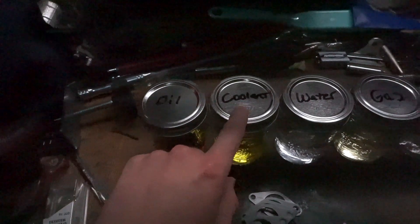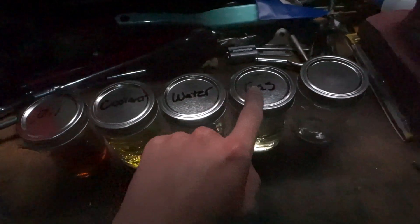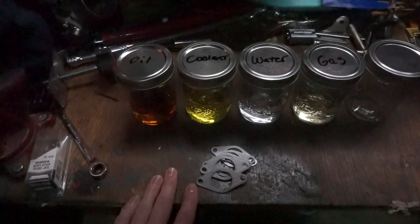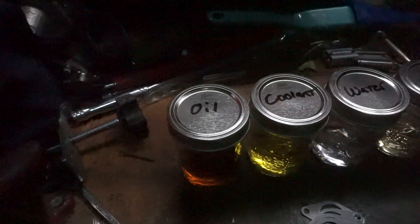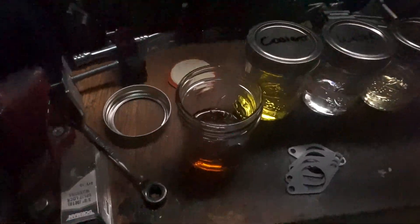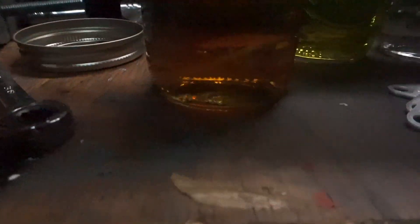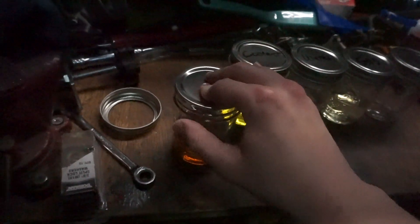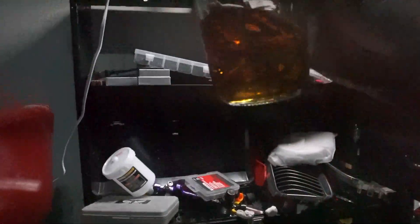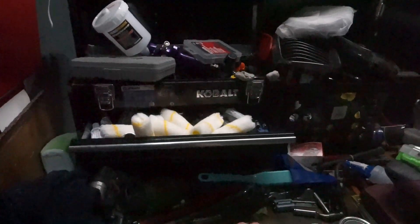If you can remanufacture something, we're going to go ahead and test and see if TPU would be worth it for gaskets. All right, everybody, here they are. I've got the oil right there, cooling right there, water right there, gas right there, and nothing right there — because these were all printed at the same time using the same filament. Let's go ahead and put them in there. Here we're putting it in the oil, going down in there. Perfect. I tried to put 100 mLs of each of these in there. There we go, so that one's going to be sitting in the oil.